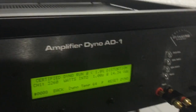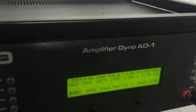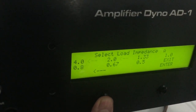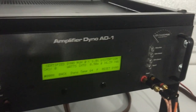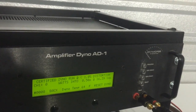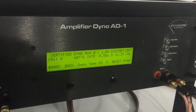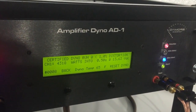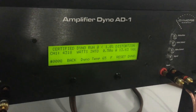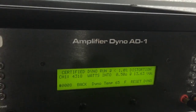That is right along with where we're going to rate this amplifier. We're going to rate this amp at 3,250 watts at one ohm at 14.4 volts. Now we're going to drop it down to half ohm. This is a half ohm resistive test — a pure half ohm load, no rise. The amp is seeing a solid half ohm. Result: 4,318 watts certified half ohm, voltage dropped to 13.63 volts.